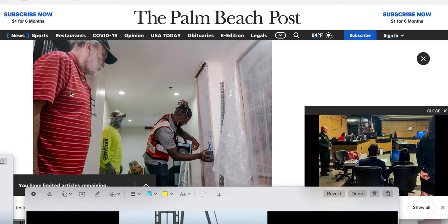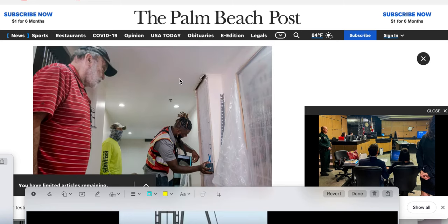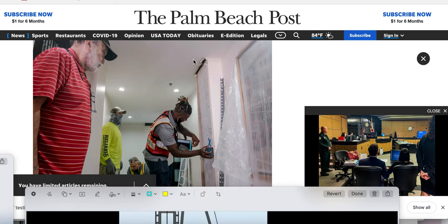So if he's in charge, he's telling them to check the column. If he thinks he's telling them to check the column, he's thinking — either he can't identify that there was no buckling out there, which is probably more than likely true, and he's just spitballing, throwing everything at everything — or he's saying, 'Look, I got to run the tab up, I'm going to check everything just for the hell of it.' I know guys that do that. I'm not one of them. I would say, well, this doesn't make sense to check there — if anything, you want to check the joint connections, where the plate slab connects to the column.